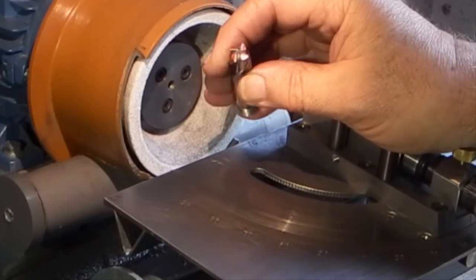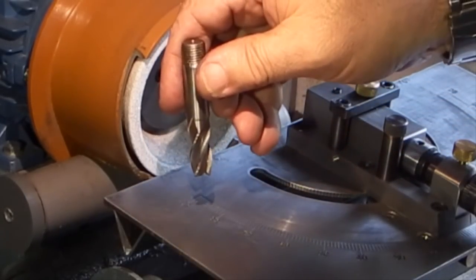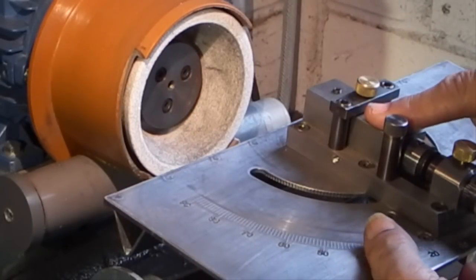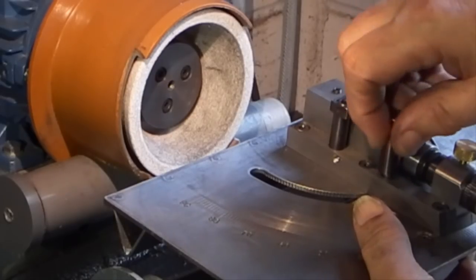I haven't got a way yet of grinding the sides, but with these end mills I use the ends more than the sides — for feeding into something or milling a flat face — so the sides are still sharp on this. I'll take this fixture off because I need to put one with a collet on that I can index.